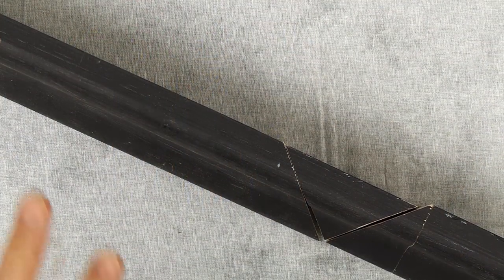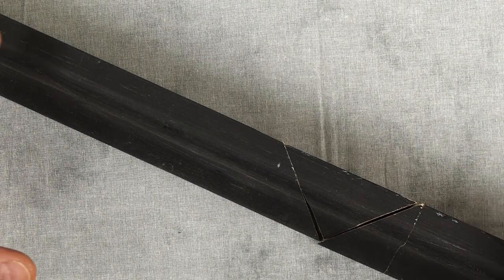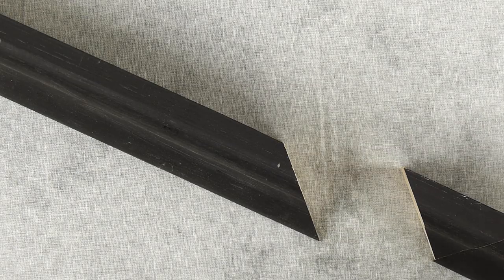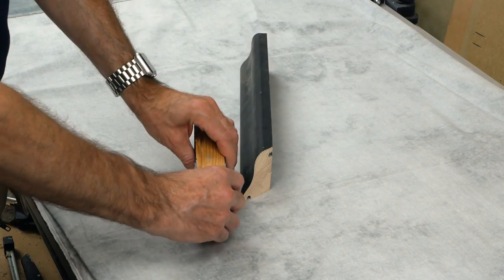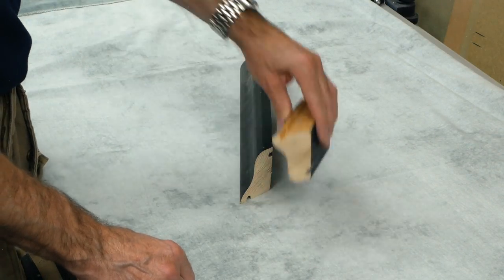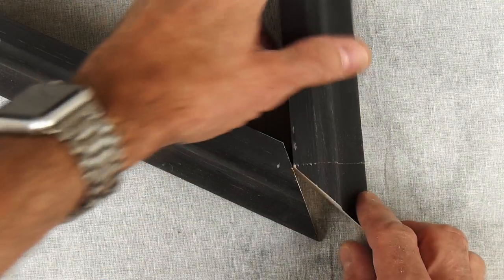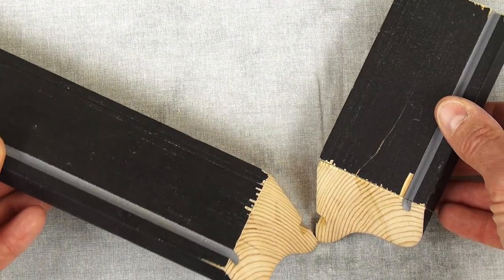Okay, so I've got this painted black just so that it's a little bit easier to see. Normally if you want to make a miter cut, you do a first cut like that, then you take the waste and you turn it, and you make the second cut like that. And that's your basic miter, like so.